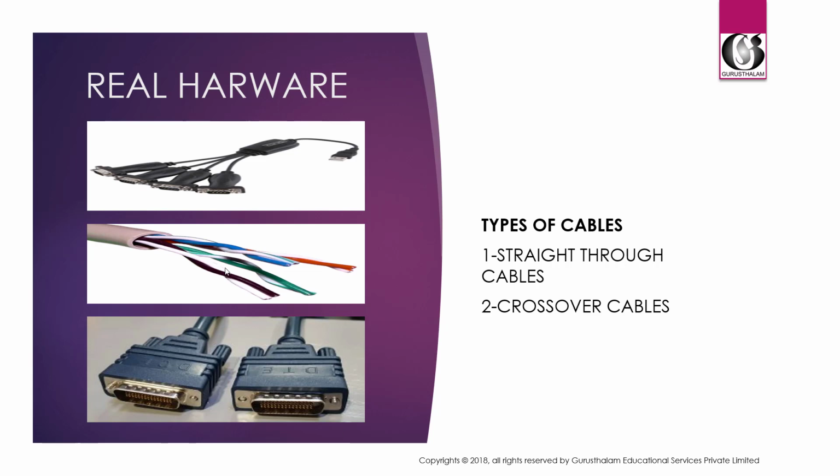This is the UTP cable between the switches and routers. You will require UTP cables. There is a difference between straight through and crossover cables. Modern switches and network cards support auto sensing, so it really doesn't matter what kind of cable you use. If you are going to connect your 2950 or 3550 switches to each other, make sure you buy crossover cables since they don't support auto sensing.